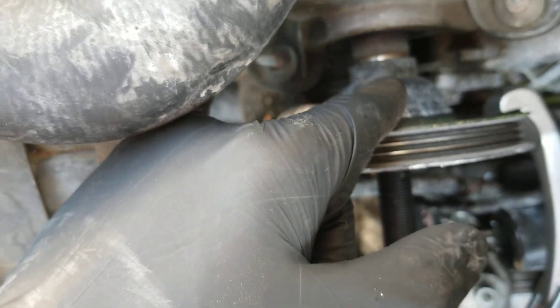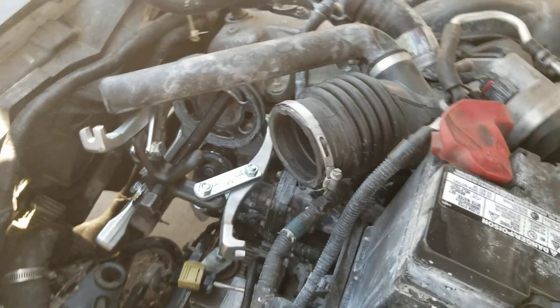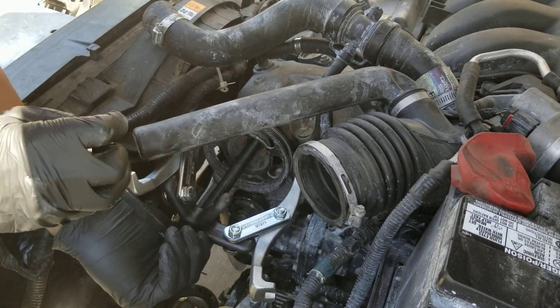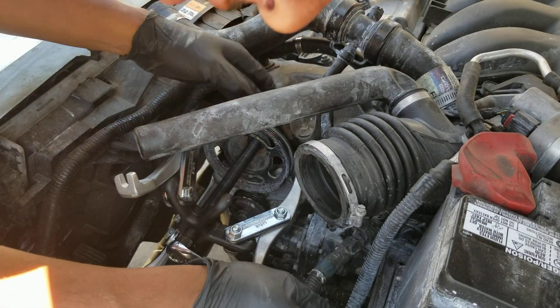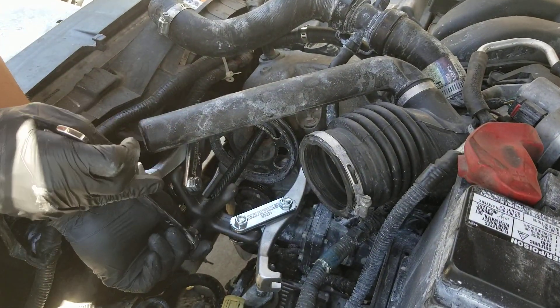You can tell it's working because you see this shiny silver surface — that's it sliding off. Make sure that's your mark to put it back, so make sure you don't clean that up or get rid of your markings to see how far to put it back. This is barely on, so it doesn't take much to get this off the shaft.